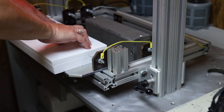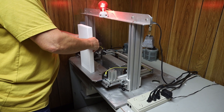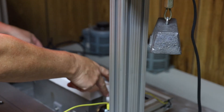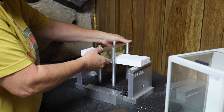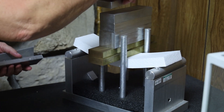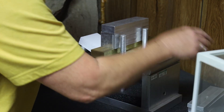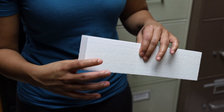The foam fabricator's plant periodically conducts flexure strength tests to make sure the products meet standards. Blocks are cut into 1-inch by 12-inch pieces using a hot wire machine, and weights are placed on top until the piece of foam snaps. This small piece of EPS foam used to make Fox Blocks can hold up to 12.5 pounds, which is much greater than the required 7 pounds, and is an indicator of a strong product made of well-fused EPS beads.